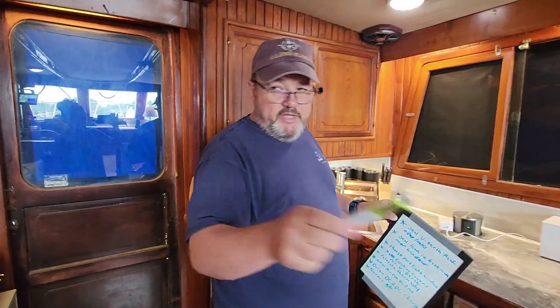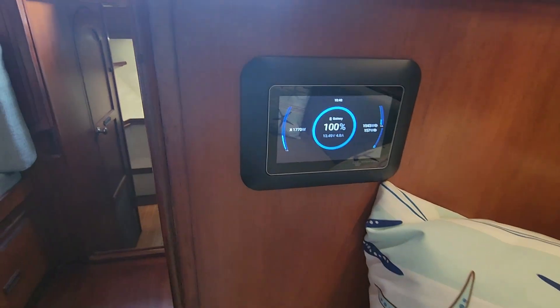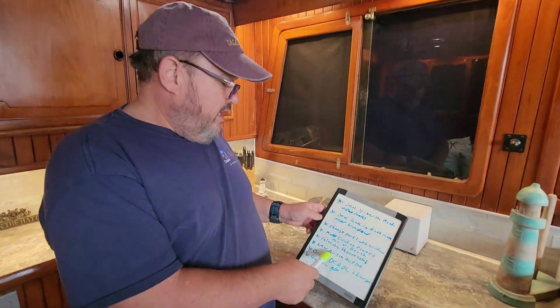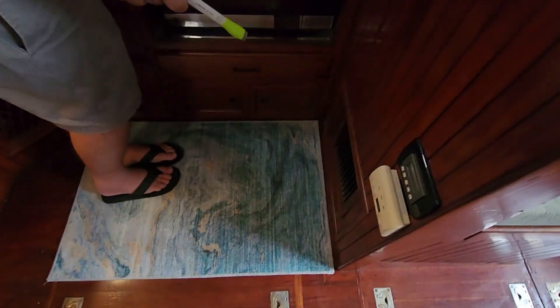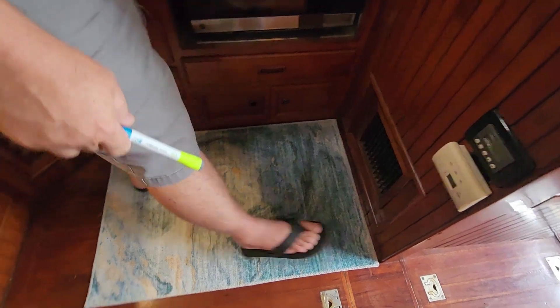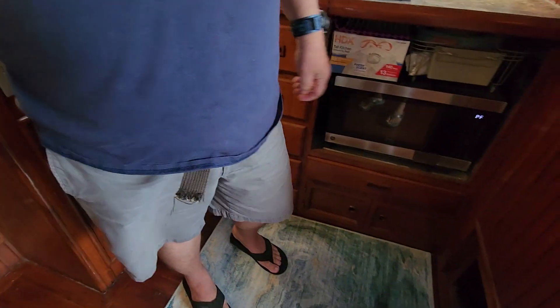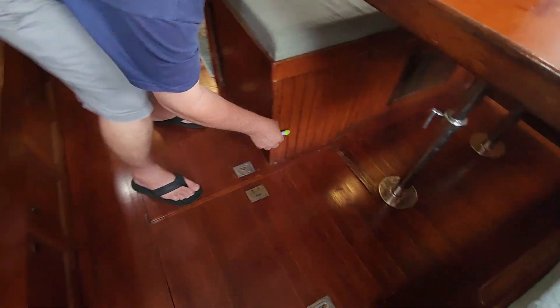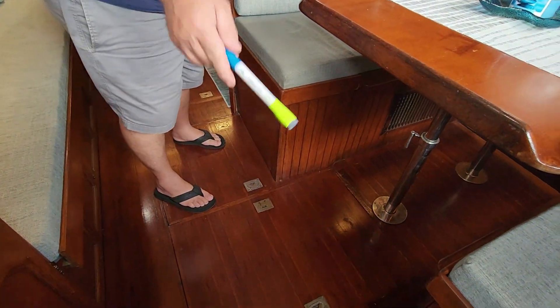When we relocate the thermostat, the Cielo is going to get mounted over there — that's basically how we will control it. We also need to add a new AC outlet. There's a main AC outlet from the Marin Air right here — a lot of air comes out there. The problem is every time you open this door it blows it right outside, so it stays cold around the galley but not towards the back. We're going to add a 4-inch duct that you can blow back over this way. There's also a 4-inch duct in the V-berth. We just need to balance the duct flow around the boat.